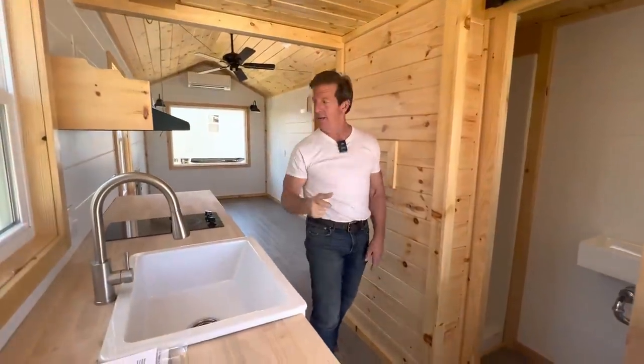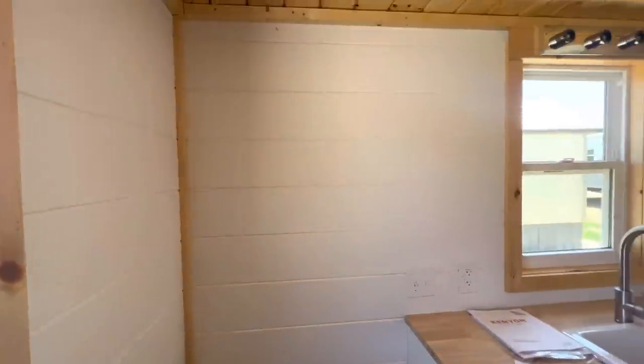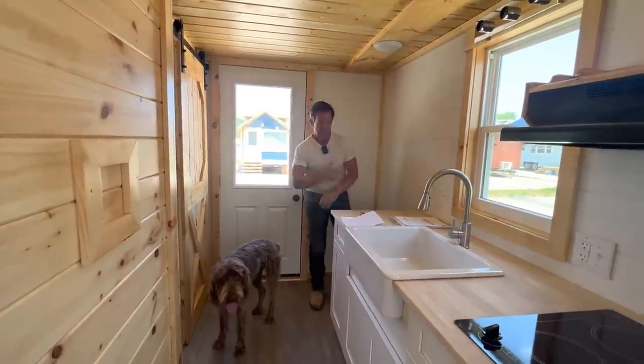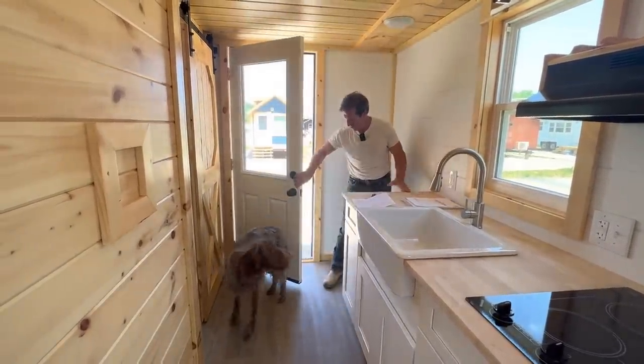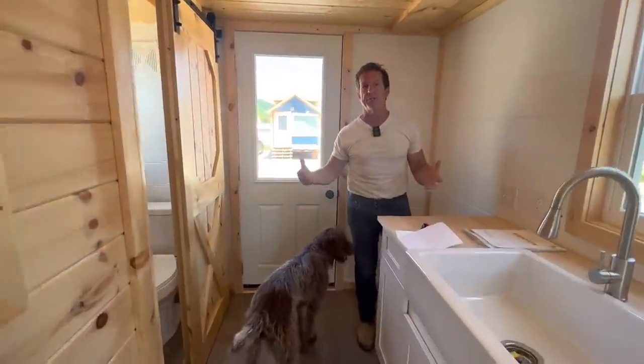So Amanda, you're right where the refrigerator goes. There's room for a full-size fridge, but the challenge is the door — you have a two-foot-wide countertop and this door has to come in. We only have this much space right here at the door. So if your refrigerator comes out 30 inches and you've only got about 24 inches of depth, that's a problem.